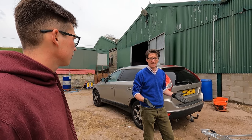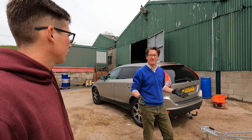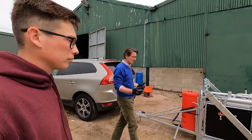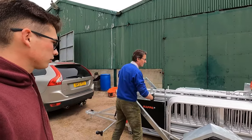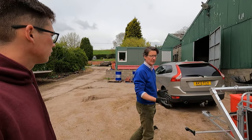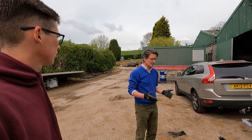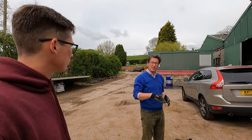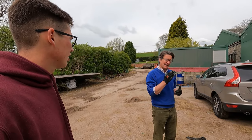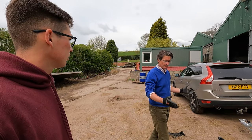Most people are working under that amount so it fits the bill. We also do a 10 foot super, which is four banks of five foot hurdles - one bank there, one at the back, one at the front on each side: four banks - and that's 200 foot of shedding because it's 40 times five. That's going to pen up near 500 big ewes on their own against one side of a fixed fence. Then we do the really big one called the tilt bed - 46 foot. The tilt bed is really overcoming the problem of legal weight because all these trailers are road legal, and being unbraked they have to be under 750kg.